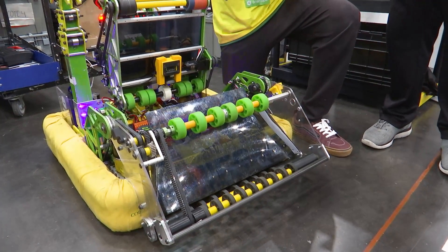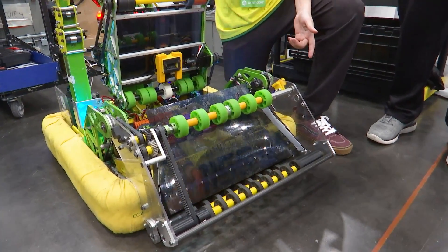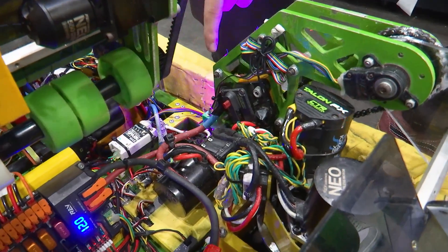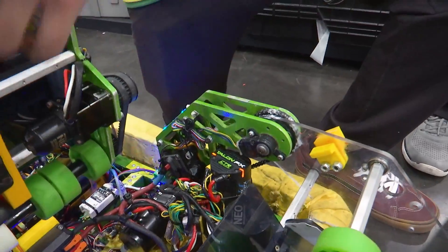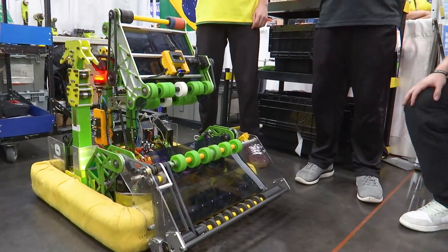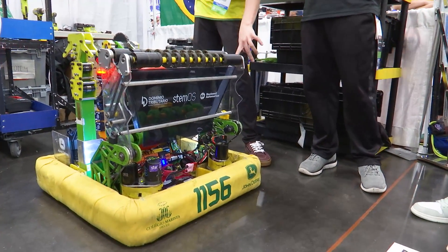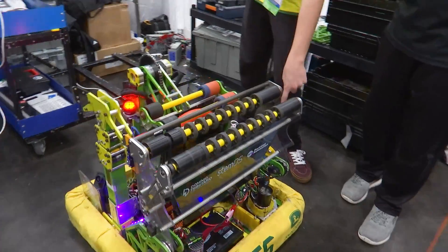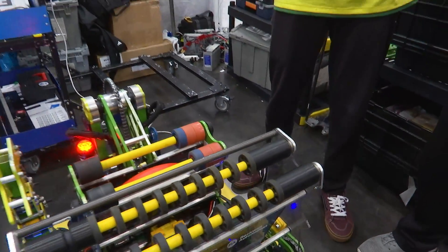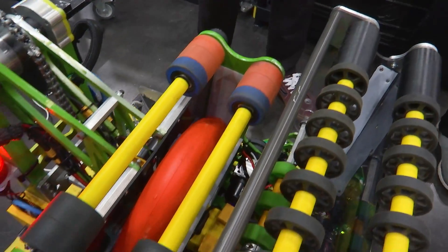We also use TPU rollers here to help catch notes sideways - when we are swerving or a little misaligned, we can still catch notes pretty easily with those. The motors are inside the robot; no electronics are outside when collecting. We have our pivot motor, a NEO with a 72:1 gear ratio, and another NEO with a 3:1 ratio as well. You can see collecting from the side is pretty easy. We have those little arc designs so the note can go in easily and travel to this PTFE tape here, which has less friction with the notes than polycarbonate does.